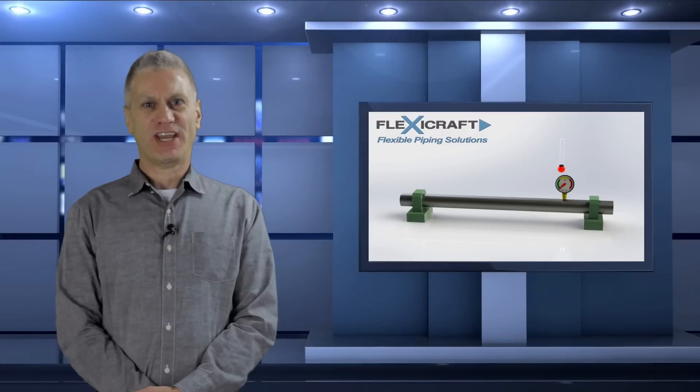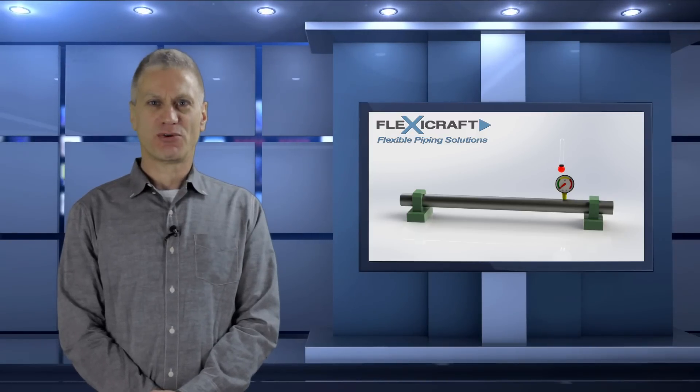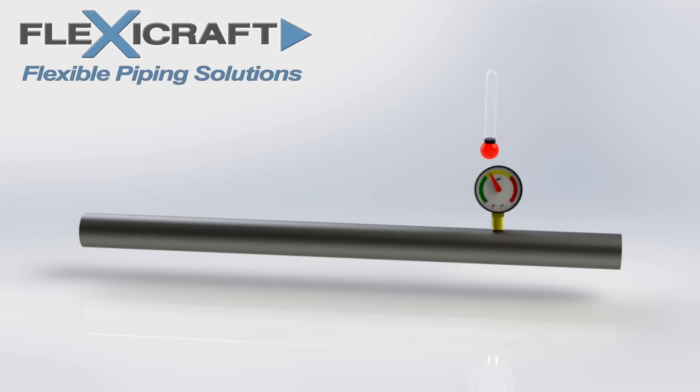The force on the plug from the pressure would force apart the bendable section but not stretch the rest of the stiff straw. That pressure force acting on the plug is the thrust load, and is equal to the pressure times the cross-sectional area. We can now go back to our pipe system model, first without the anchors. This time we pressurize the pipe instead of heating it up. The pipe acts as though it's plugged, with the thrust load acting on both ends because of elbows and other ends down the line. Notice there is no movement of the pipe because the pipe wall is too stiff to be moved by the thrust load.